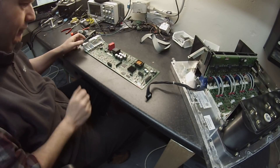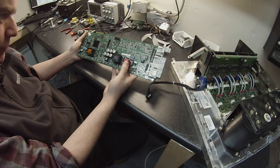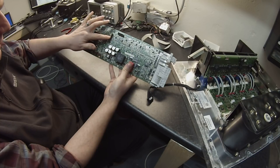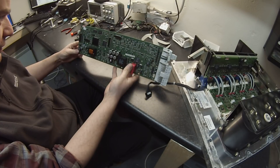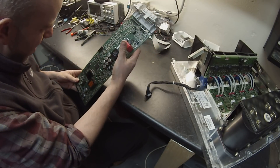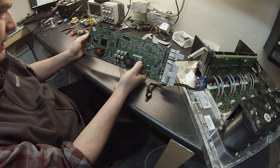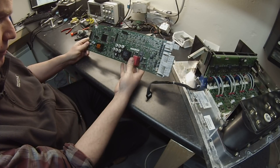Welcome to the logic board — it's big. This is going to be quite a challenge to figure out. The good news is we only need to figure out about 1% of it: the part that relates to the IGBT drivers and the current sensors. There's some serious processing horsepower here. There's a Spartan XCS20 — I'm not sure exactly what variant that is. There's some RAM up there for that, and another component under a heatsink, plus a lot of other stuff.